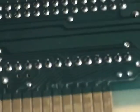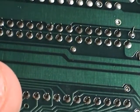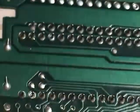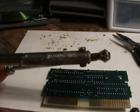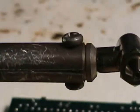Each one of these little pins here has to be desoldered. Desoldering you have to be really careful because when you pull the chip out, if it's not properly desoldered, you'll end up ripping parts of the board out and then the board is junk and you can't fix it. This is a desoldering iron — the tip has a little hole in it, and that's what you put over the little needles on the end of the chip. These are MASKROMs, sorry.